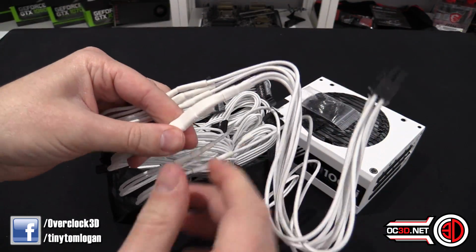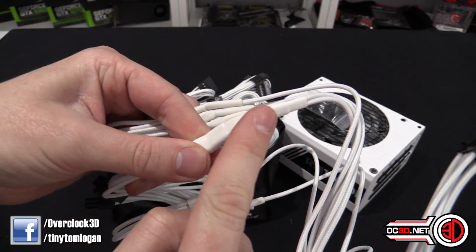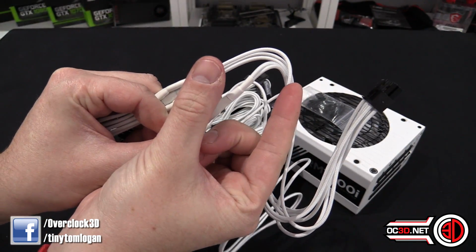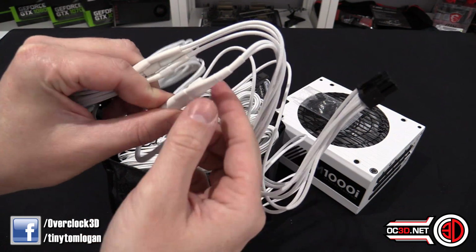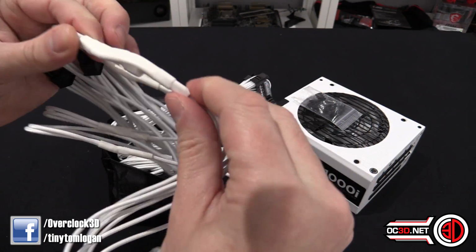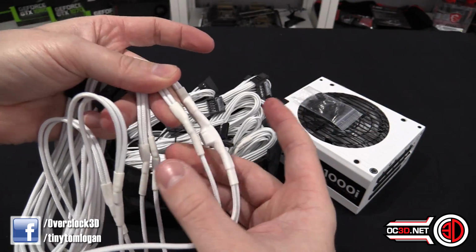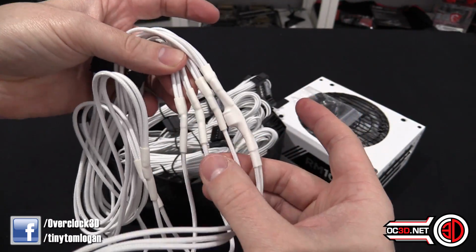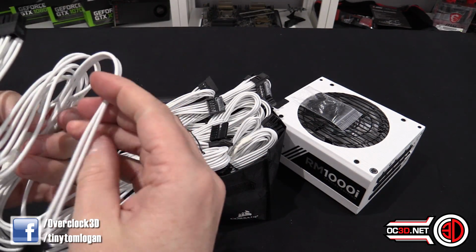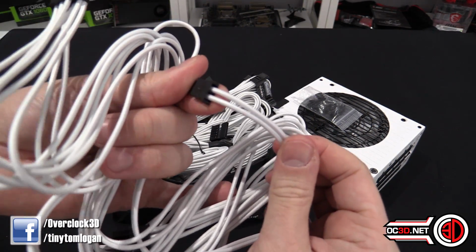This was actually something, again, that I suggested, because when you go over the capacitor, you can have a big wide split up here. So by putting the smaller bit of heat shrink over this end, it brings it all in and tightens it all up. And don't forget, this is the first time I've seen these as well. The joins on these are really, really good. I have no quibbles, none at all. But anyway, you can see that they are really nice.